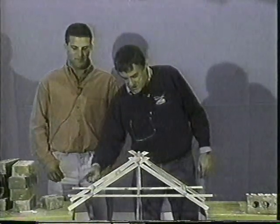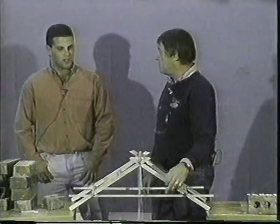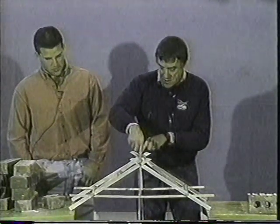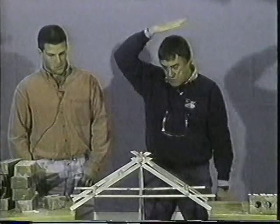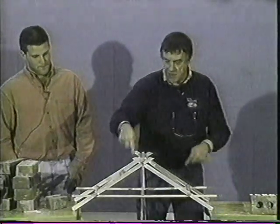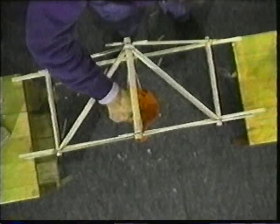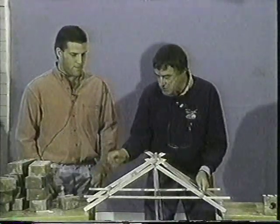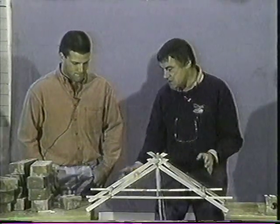This is a pretty straightforward king post truss. It's taking the weight from the top, and it's logical to think that just as when you push down your legs will go apart, when you push that down the diagonals will spread. So this will go into tension at the bottom, which seems to suggest that's where the weight is transferred.